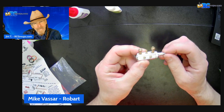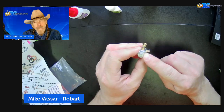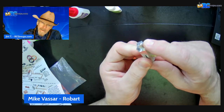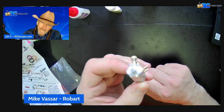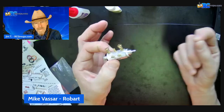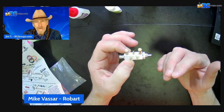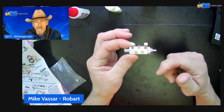And it is also serviceable. On the end of the valve here, there's a little retaining ring. If you remove that retaining ring, you can completely remove the valve stem, and then you can re-lubricate the seals that are inside with white lithium grease — a non-aerosol. Do not use a spray; use a tube grease.